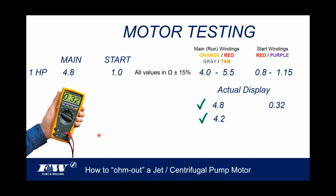that's not good. You see that? That's not good. That's not within the range. So what I'm going to tell you about this would have pertained whether it was this one or this one that was not within the range. What we're seeing here is that it's lower than the published value, right? 0.32. That's lower than the published value. That's a failure right there, because we had a value that came in lower.